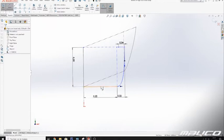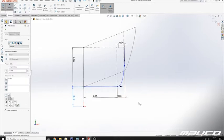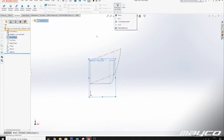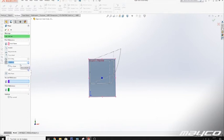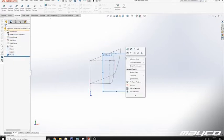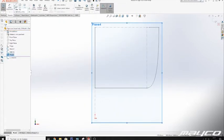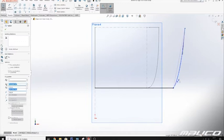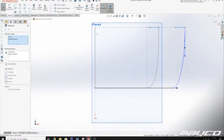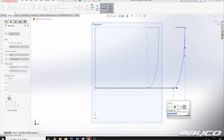Now, looking at the chassis, you can already see how narrow it is, and also looking at the car that I'm showing in the beginning of the video, you can see that it should be very narrow to allow the body and the chassis to work together. So what I'm trying to do here is get some of the points that are important for the chassis. Where is it the most narrow, where can it be a little bit wider? Those points I'm trying to get right, so that when I put the top body on, I'm not hitting anything. So first things to look out for are most likely the front crash box for the side protection, and also the rear crash box mounting points, because they are quite wide for a body that should have something like a boat tail.